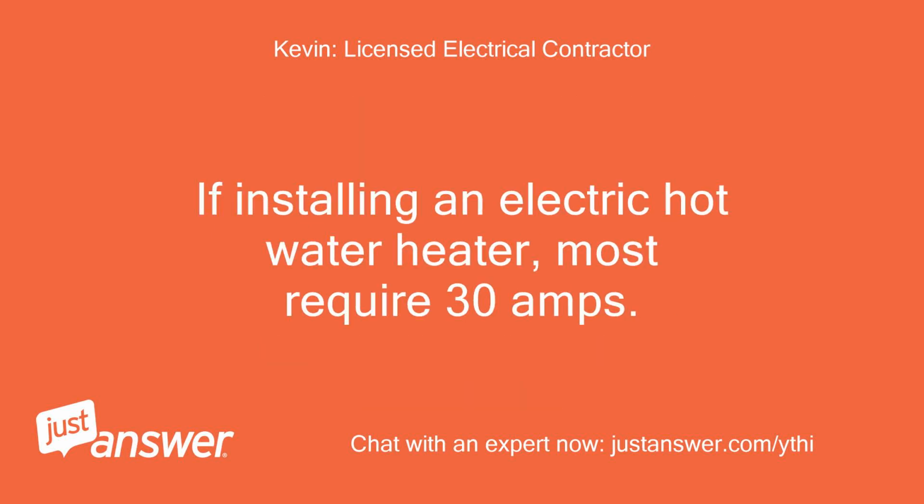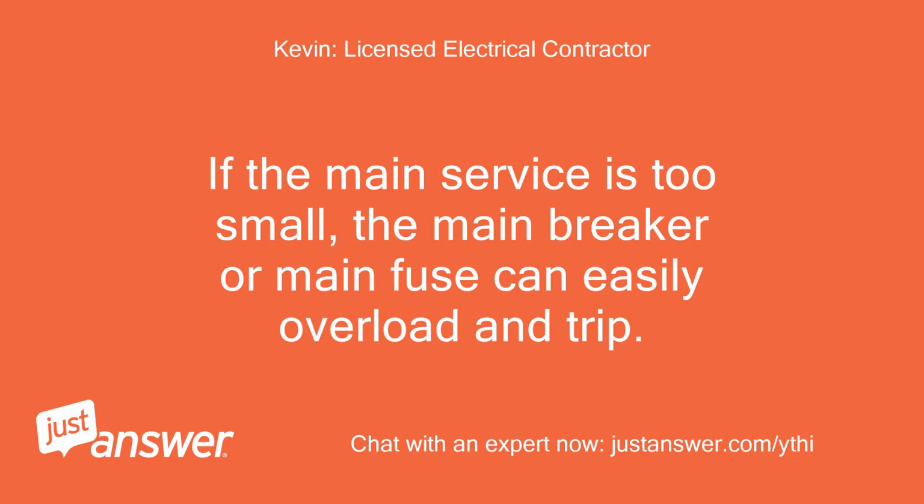If installing an electric hot water heater, most require 30 amps. If the main service is too small, the main breaker or main fuse can easily overload and trip.